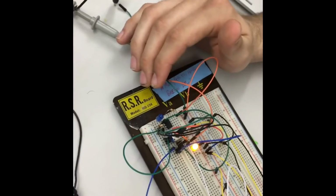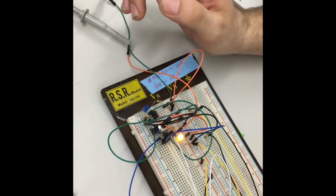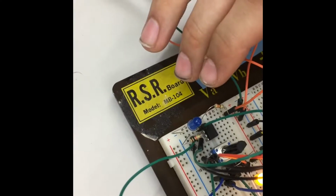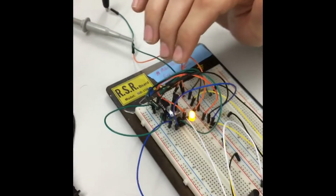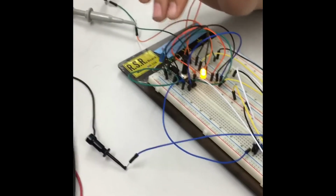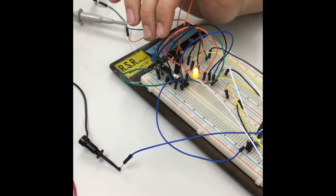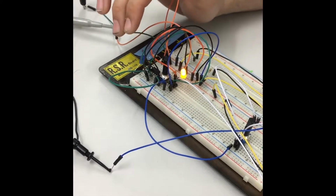The signal amplifying stage is coupled with a diode that serves as a source of visualizing what the gain is in the circuit at the given time. This is coupled by a potentiometer that allows for variance of the gain of the circuit. In essence, when the light is on, we have too large of a gain in our circuit, and when it's off, we have too little of a gain. So this was used to set about the middle point threshold by picking when the LED was dim but on.